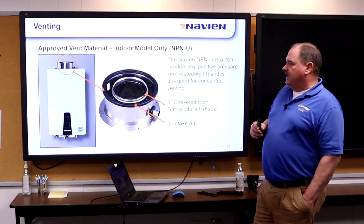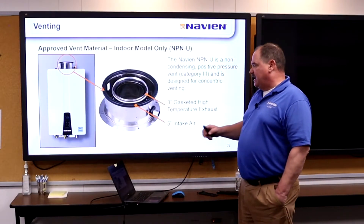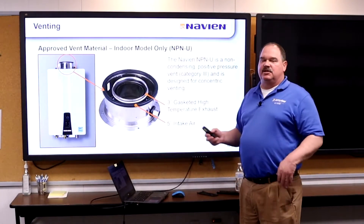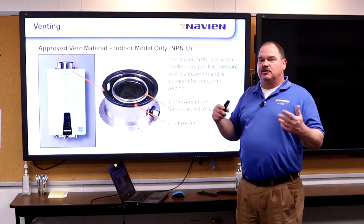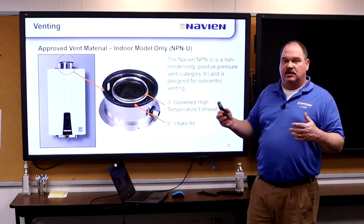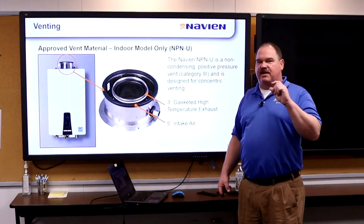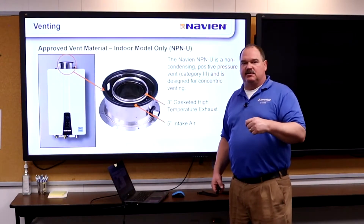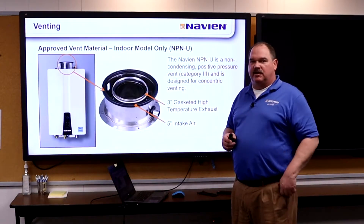The venting is inner wall and outer wall, stainless steel on the top connection. There is an internal dam with a little drain. As you vent the unit up and out on a short run on the northeast side of the house, you could have weather blow up in there. This connection should be hooked up — it's just a 5/8 connection. Slide a piece of clear poly tube over it, zip tie a little pigtail in it, put some water in there and you're good.